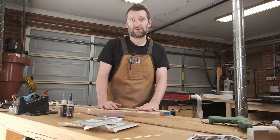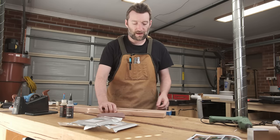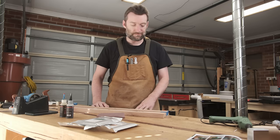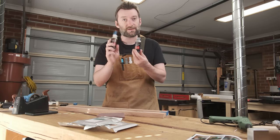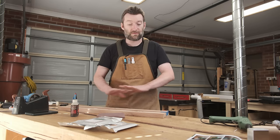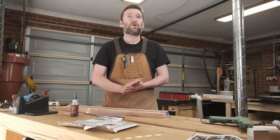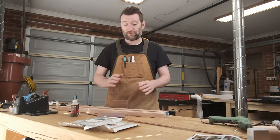Unfortunately I work with a lot of Australian woods, and Australian woods are known for having some gnarly sap and bark and other inclusions in them. Eucalypts are quite gnarly woods. Sometimes they're quite easy to manage — smaller stuff I can use CA in various tinted flavours to fill the gaps so that I have a nice smooth surface, but when you get to a larger knot, epoxy is often the only choice, or at least that was the only choice I was aware of in the past.